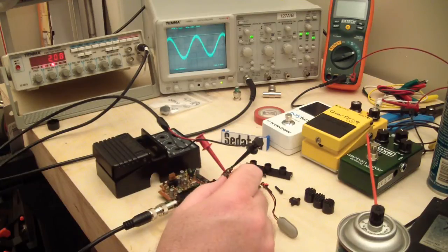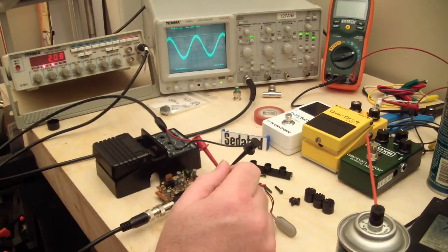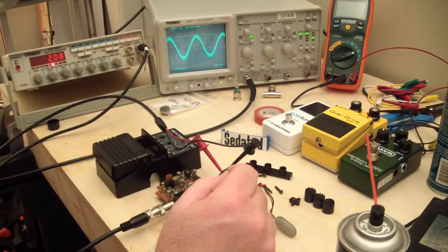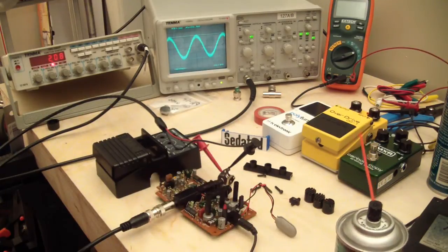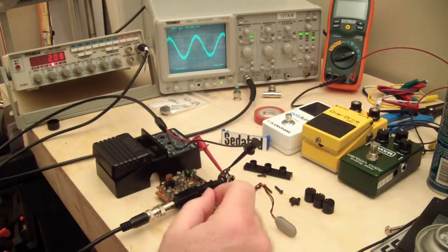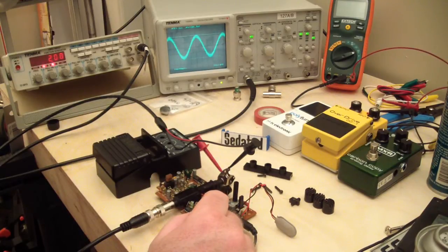It was pretty noisy sounding in my amplifier, a lot of static and stuff, so it definitely needed cleaning. So I took it out of the case, and so far what I've done to it is I've cleaned it with a little DeoxIT fader. I've checked it on my multimeter after I cleaned it to see if it was still having the proper resistance, and it was fine.